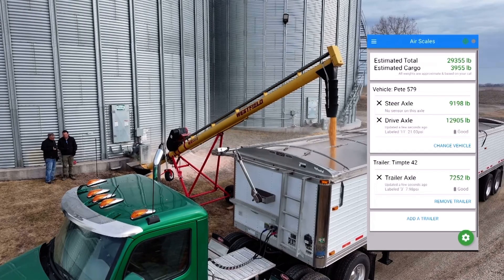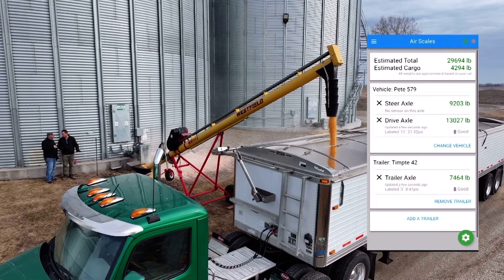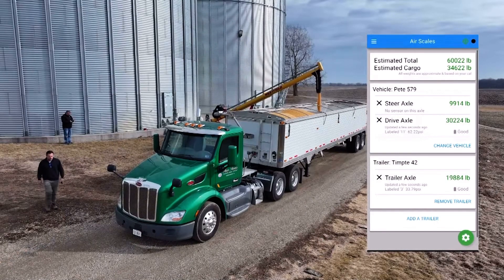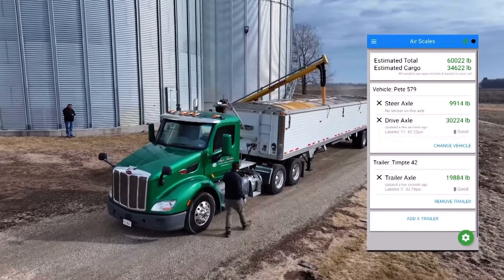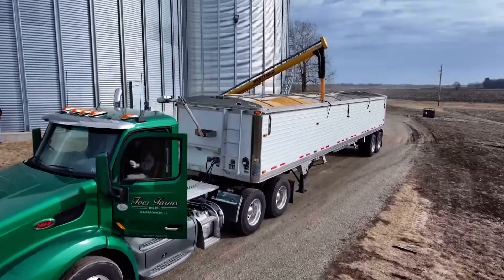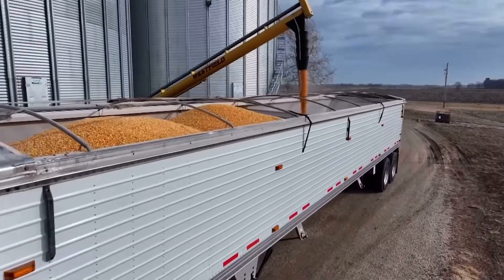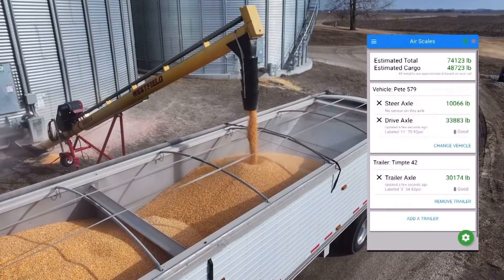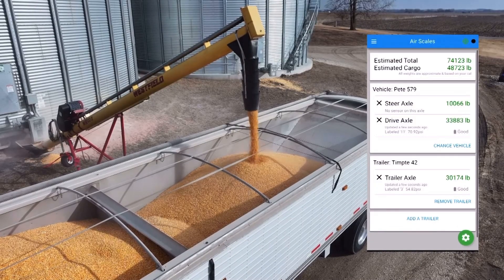The challenge loading a truck — and I think for everybody pretty much all the time — is it's a delicate balance. You first of all need to stay at the proper overall weight, but most importantly, you also can't overload the axles. That was the biggest thing that Matt liked about this. Because it's too easy, especially with high-speed unloading systems, to get an extra 2,000, 3,000, or 4,000 pounds and not really realize it. The nice part about this technology is it's showing you what you're putting on the axle.